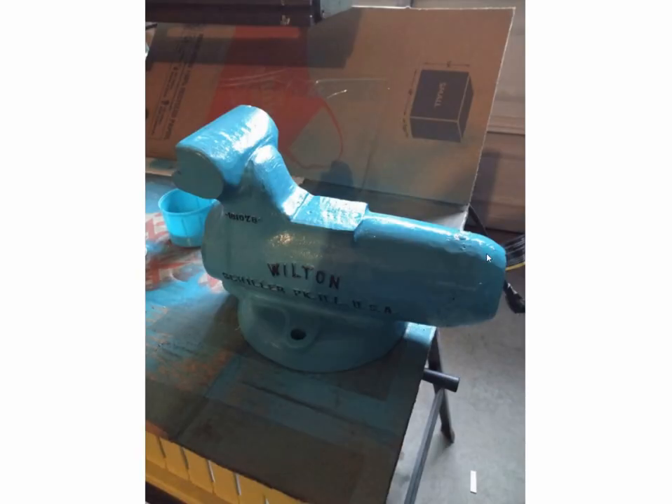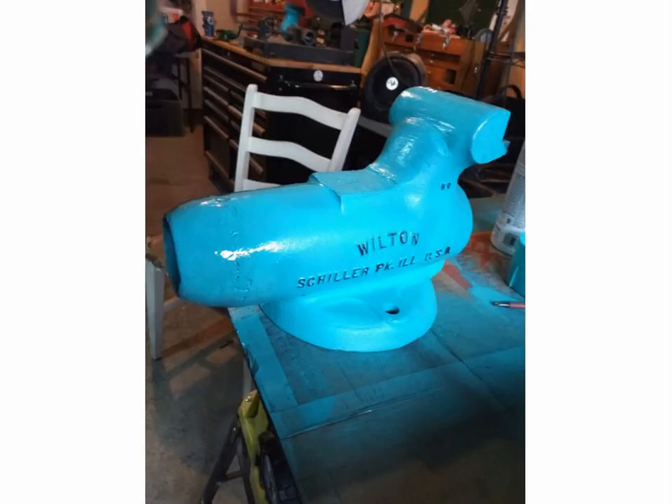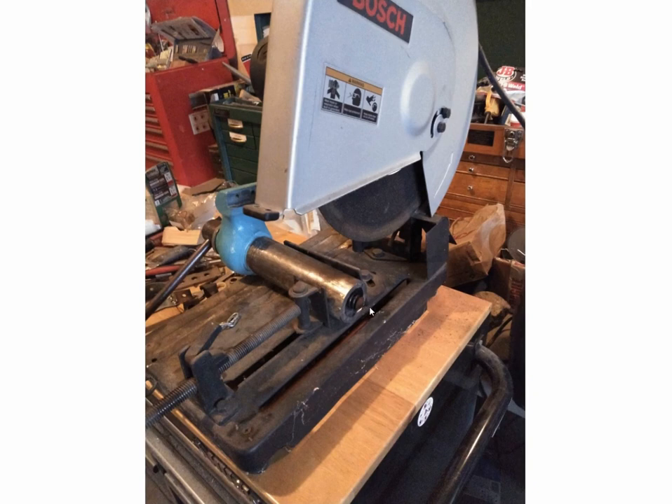So I just cut it off both ends and painted it up — now my vice is not coming apart ever. Well, you could drive it out from the bottom. There you go, the pin is in there. The screw would normally come through almost to the cap, within about half an inch of the end. What I did is cut the screw off because I don't want this vice to open that far anyway — I never open a vice that far, and when they get out that far they're loose and flopping around. I cut off approximately three-quarters to one inch of the screw.